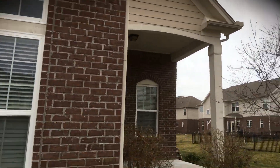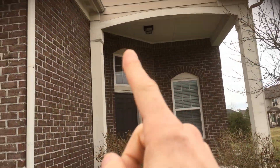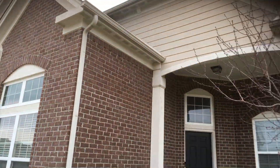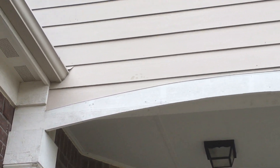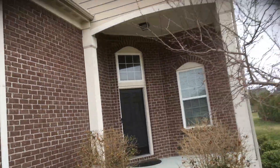The front door, front porch area — all that's included in the pricing. These little decorative pieces above the windows are included in the pricing. Got a little bit of peeling on this hardy board right there, so we'll need to make sure we use a masonry primer since it is a composite material, so that it does not continue to peel.